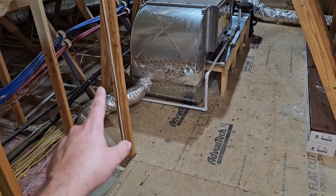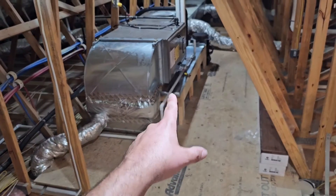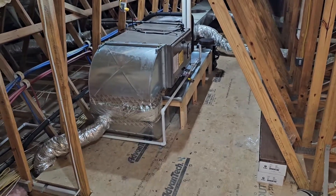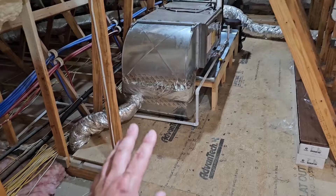This is a good way to add fresh air and it's super simple and it's the cheapest way. You can also add a damper — a six inch damper for that line — and have that tied into the call for the fan so that when the fan kicks on it opens that damper. That's just another way to make it even better.